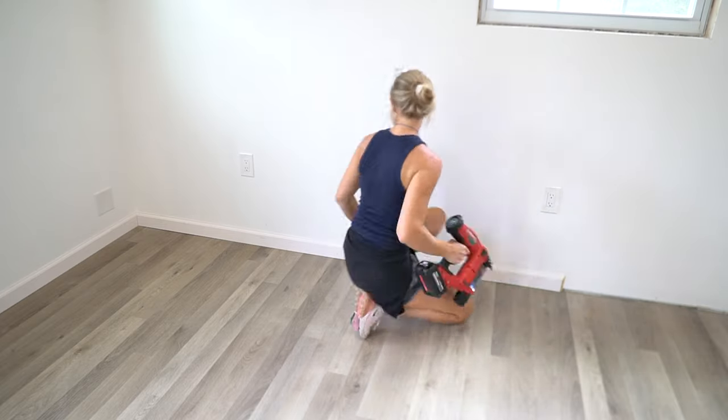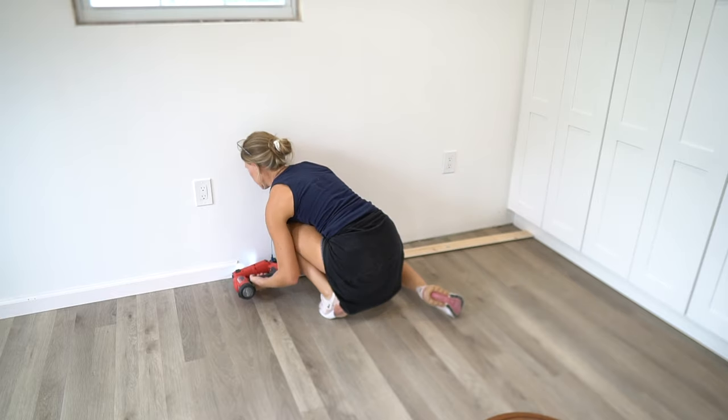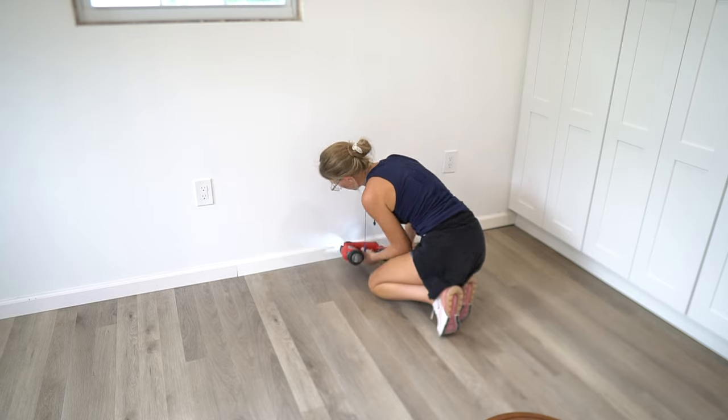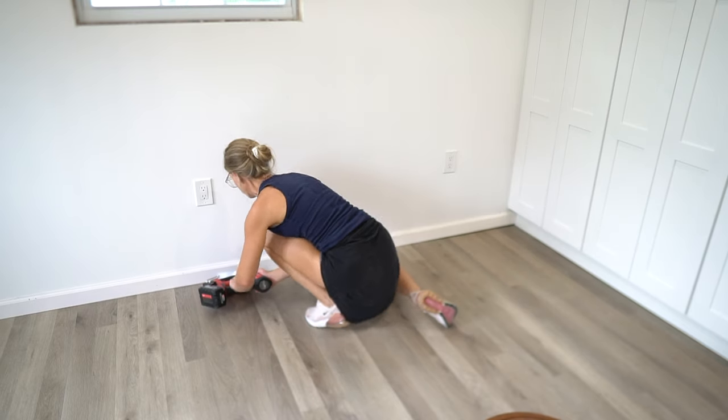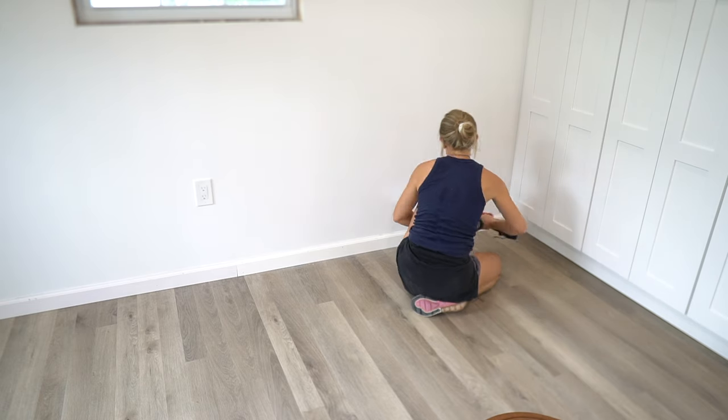less visible. These floors are a little wavy, so there were some gaps between the baseboard and the floor. You could scribe the bottom of the baseboard so that it fits tight. You could also use some small shoe trim to hide any gaps. I didn't think the gaps were too noticeable here, so I'm leaving it as is for the workshop.